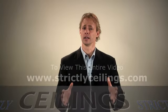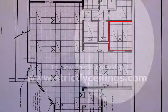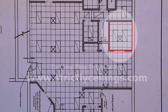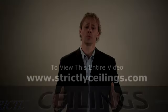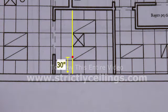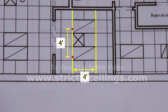Let's take a look at a blueprint for a basic room. First, we will need to determine which way our joists run, as main runners and wire rows will always run perpendicular to them. After placing the first wire, you'll then want to install another wire 4 lineal feet from the last one. Because mains are spaced 4 feet apart from one another, your wire rows will follow the same spacing.